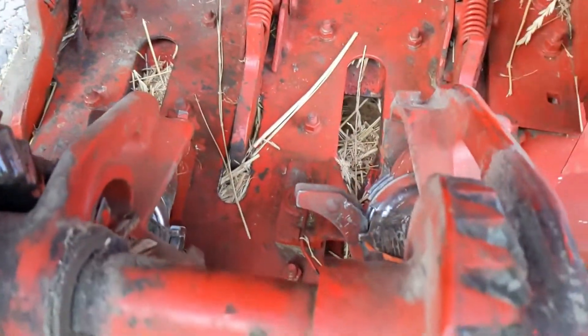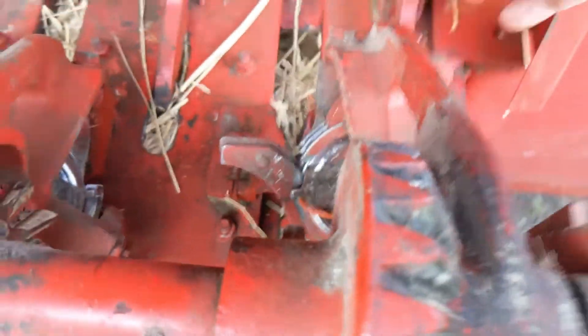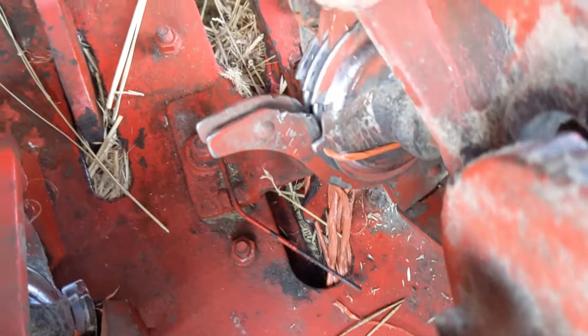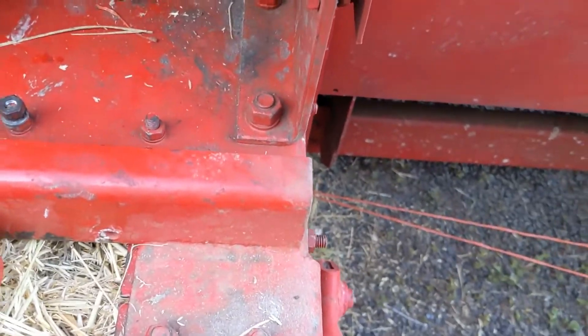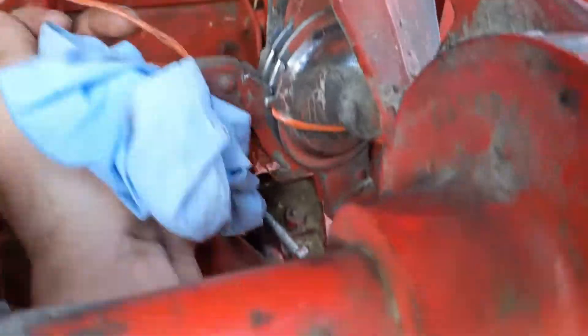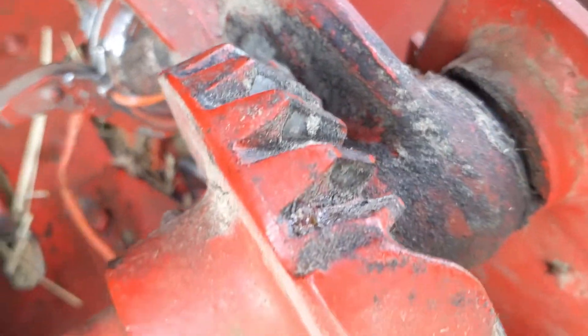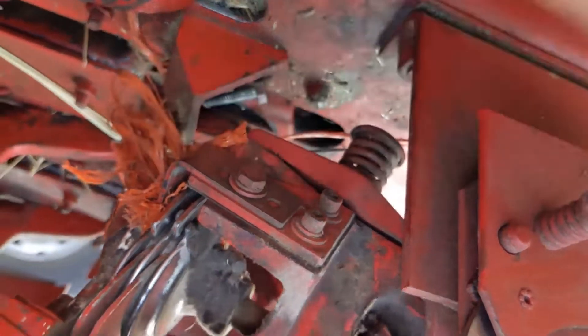In this case because the line hasn't broken - it's just jammed - and when we try to pull it up it's getting stuck on this bale here that is partially baled. So we're going to need to cut off that bit, and probably just cut off those tails as well so we can rotate this up. We got all of the tails cut off and we cut the piece that was attached to the bale way back here, so we've got a long section that was actually threaded so that we knew what went to what. This came from this new bale - it's trapped in this thing, which I don't know the name of yet. We'll check the manual. But all of this mess back here kind of seems to be stuck on this blade.